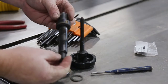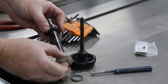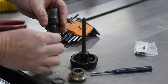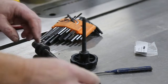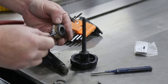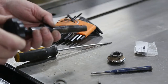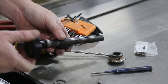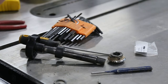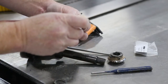You can see the shaft set up here — this is where your handle bolts on, and the gear goes on here. That's the little key right there, so we'll pop that out. These are 2.5mm Allen wrench there. See when I turn this in, it kind of pushes it up. This one's in pretty good shape, but it's a little worn on the outside, so we'll put a new one in there and see if that fixes our problem.